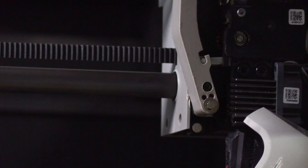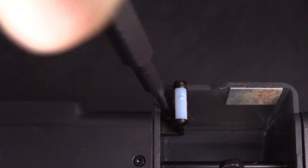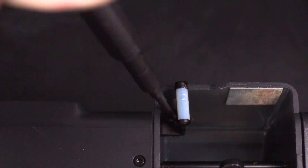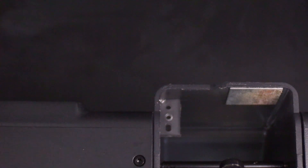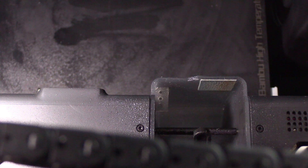The lever can go in, but it can't come out. Here is a top-down look at your Bambu wiper. It might be a little simpler looking than you thought. There is one simple screw there holding the wiper on. I will go ahead and unscrew it now, then simply lift up the entire wiper. While you're here, do you see how disgusting that little pad in the front of the poop chute is? Let's use a cloth such as a Blue Scotts shop cloth, even a little IPA. I'm actually using glasses cleaner, which is a very light alcohol water solution.